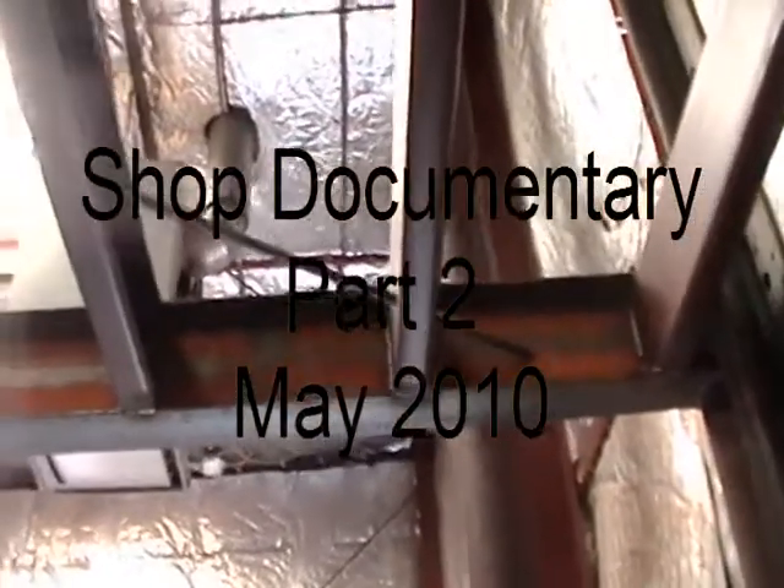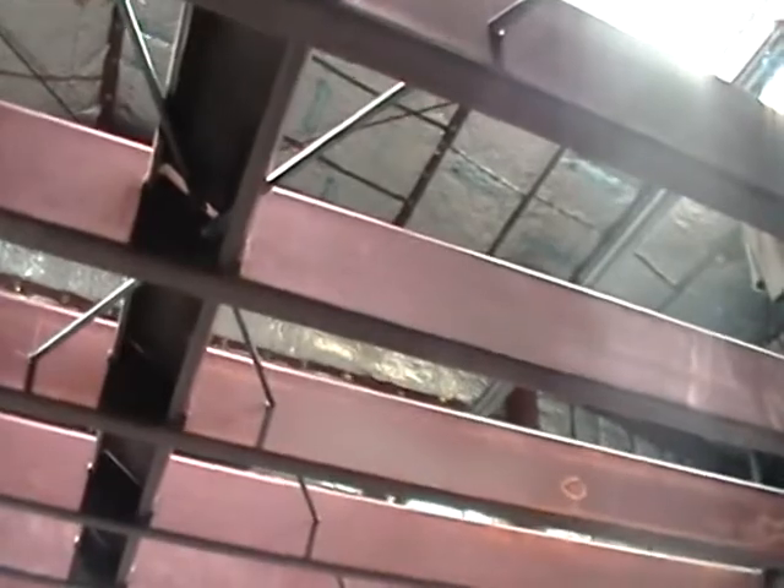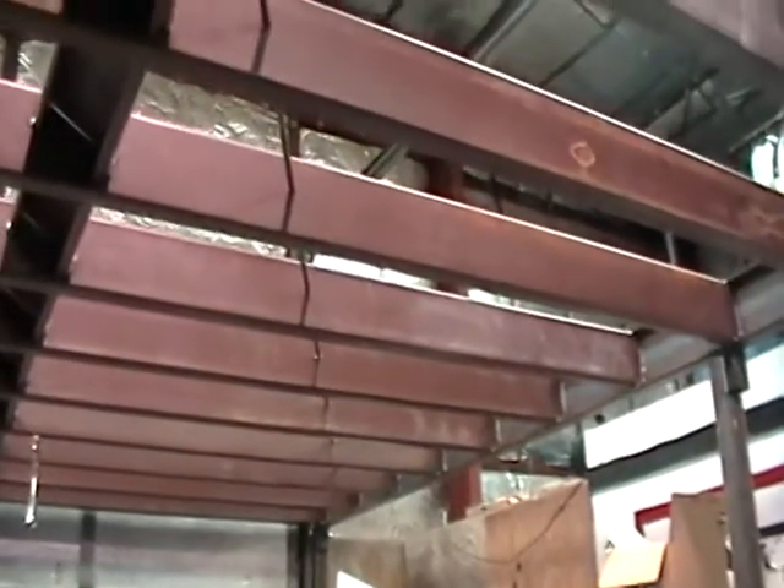Here's another installment of the construction of the second floor. As you can see, there's a diagonal piece coming across between the floor joists. This piece goes long, all the way across — it's a half inch hot roll. And you can see there's another one; they actually make an X. This is the X bracing that will keep the platform from shifting laterally. It gives it strength to support sideways loading and will make it more solid.